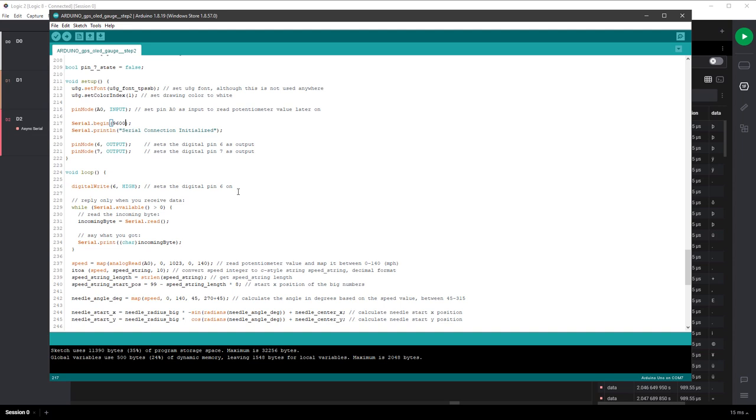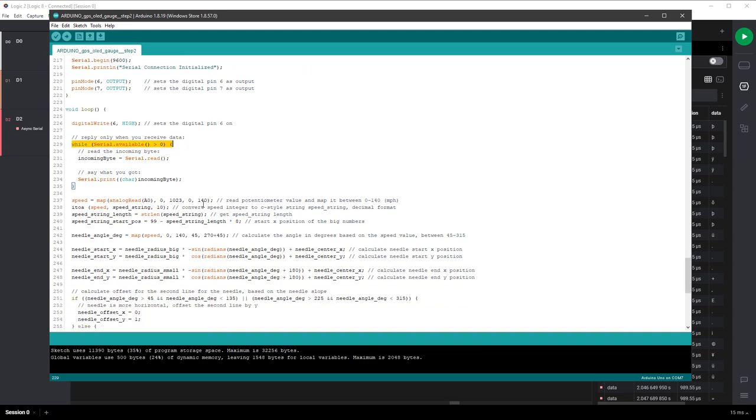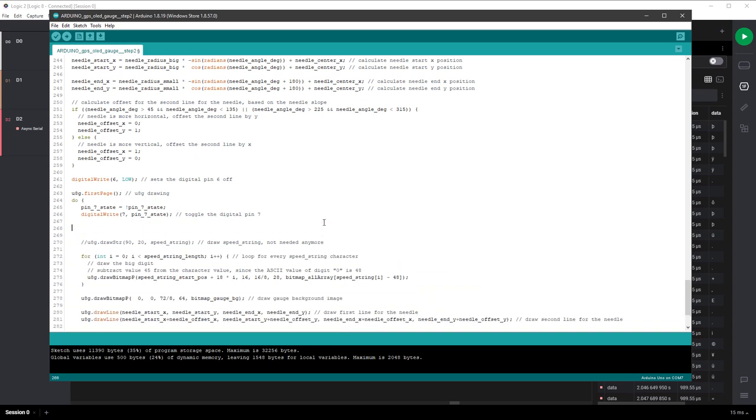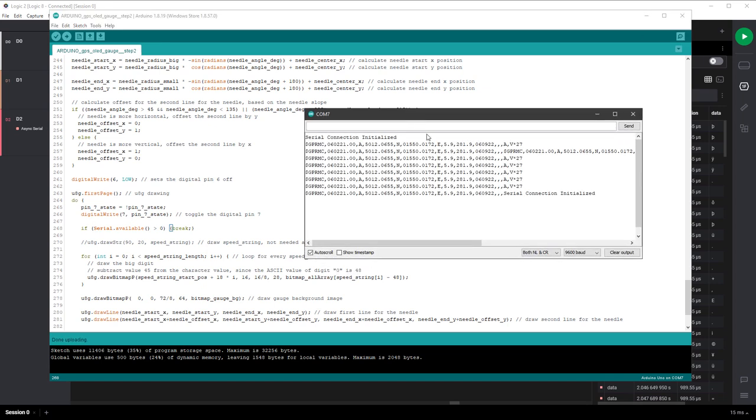During the drawing stage, we should also check the serial buffer. We can say: if Serial.available is greater than zero, exit the loop by calling break. That should fix it completely. If I open the serial monitor and paste the message, I see the full message every time I press send. Even without the analyzer, we know we are getting the full message.